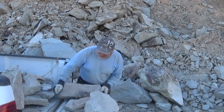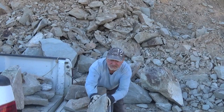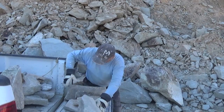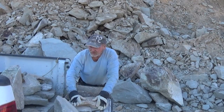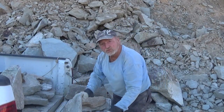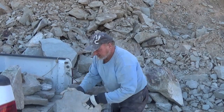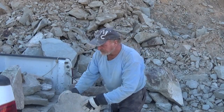What I'm going to show you in the next steps is how to take a rock like this. Notice that sharp edge — nothing's going to sit on that edge, nothing's going to balance anyway. I'll show you how we make it just as stable as a chunky rock. There's a way to do it in the design of the rock. So what that means is you don't worry so much about the shape as you worry about the face. I look for a rock face — this is its face, and you don't worry that you've got a pointed edge, because I'll show you how to work with that.